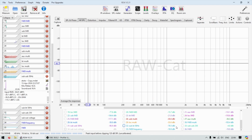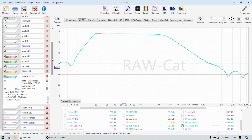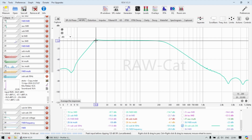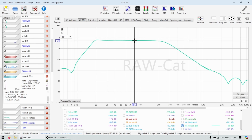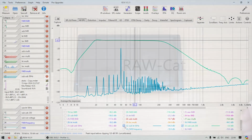And the last one, just for you to show, is the subwoofer frequency response. So this head unit, as I mentioned, has a built-in high-pass filter at 20 hertz, unless you're using auxiliary inputs. And this crossover, I think it was 250 hertz, the maximum that we could. Yeah, it does go down. However, you can see it's flat. It's very nice. So the RCA output of the subwoofer is nice, as long as you don't use the Bluetooth.